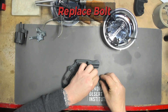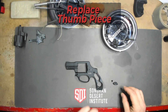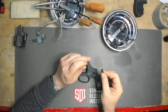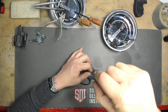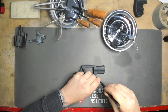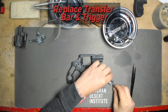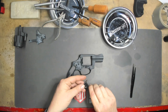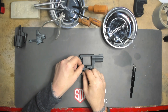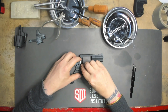Go ahead and put our bolt back in with the spring here and try to keep it in there — we can get it with our fingers. Next we will reattach our thumb screw and thumb piece. You can see it's notched already. Next we will put our cylinder stop in. I'm going to be using just the pliers — it's one of those temperamental pieces to put in. Next we're going to reassemble the transfer bar and trigger. I have a neodymium magnet on here just to make it a little easier so it doesn't slip out. It just goes right on this leg here. We can do a small functions check after we get it set to make sure we're on — and we are on.